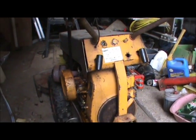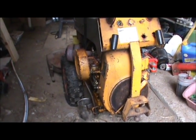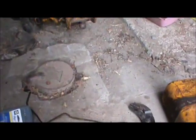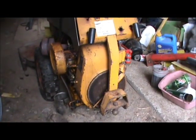I'm working on the Commercial 12 today. What I was working on is the fuel system really. It was kind of leaky to say the least. The petcock on the tank was leaky and this old steel line was rusted — it was soft and leaky. This thing wouldn't hold a tank of gas to save its life.